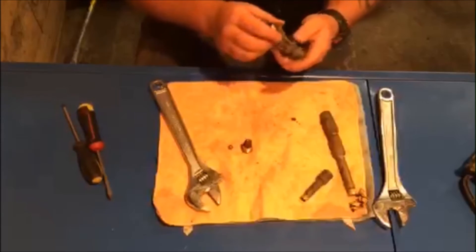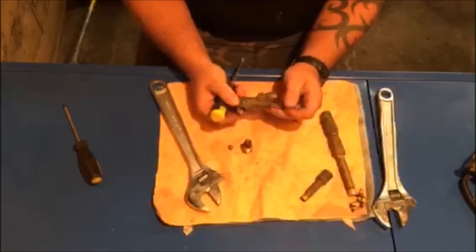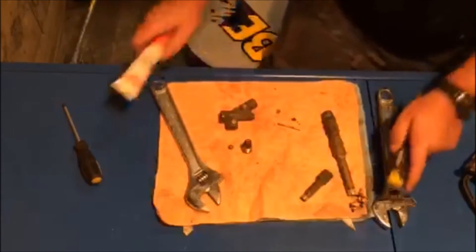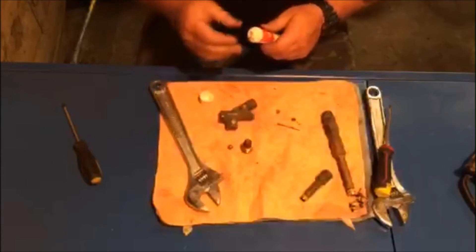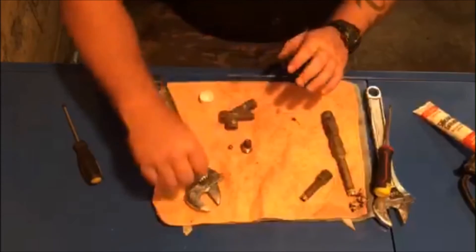As you can see here, this pin can come out. Now if you're going to rebuild these, I always use a little bit of silicon grease on the pin — not a lot, almost nothing. Just basically coat the entire pin up and down with a little bit of silicon grease.